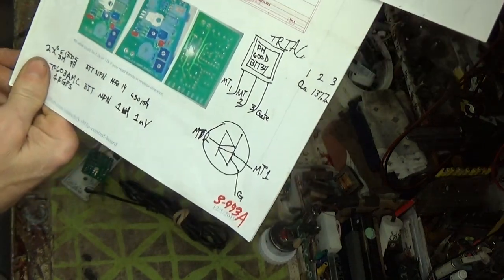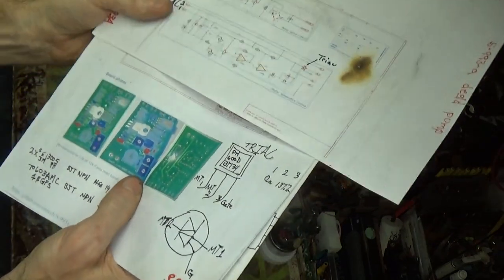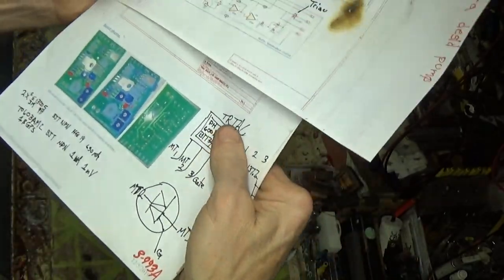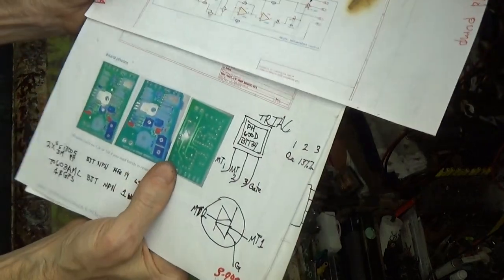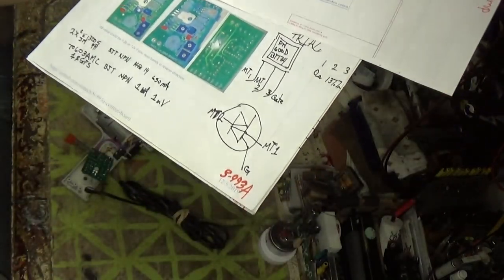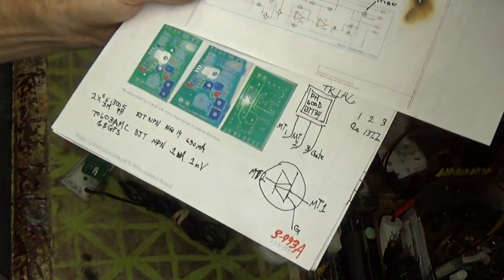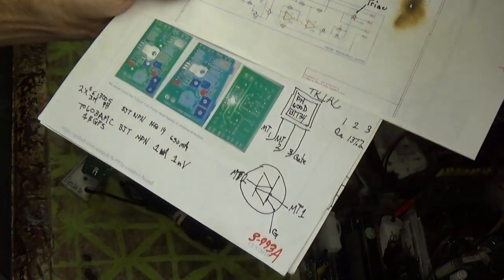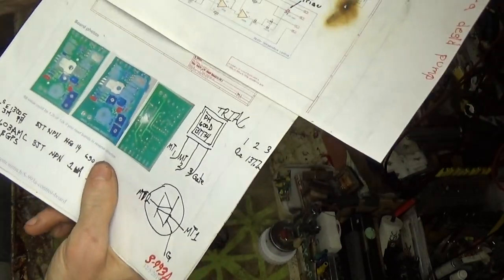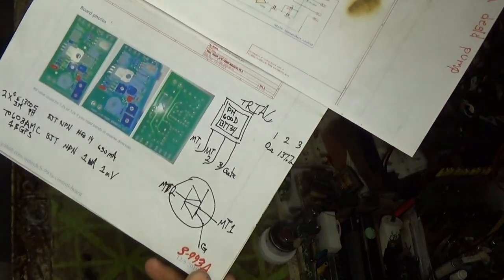So really, that's not enough to beep on my meter if you put it in continuity beep mode. It's something people don't realize: there's got to be a cutoff. You're not going to have it beeping at mega ohms, because you could hold it in both hands and it's not going to beep when you're running continuity testing. I believe mine's at 40 ohms. Anything greater than 40 ohms, it won't beep. So that's the cutoff, and that seemed to be the case with two of my units, but mine are cheap, so who knows.